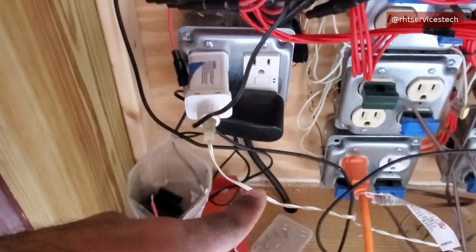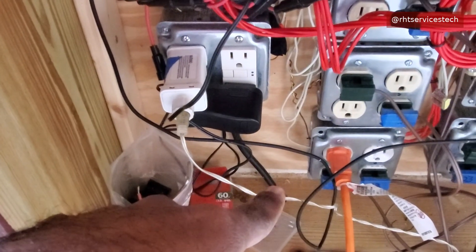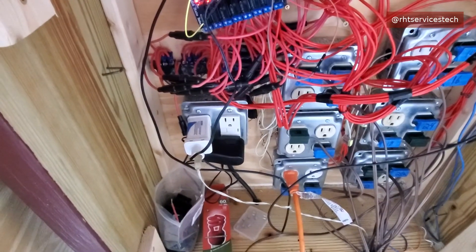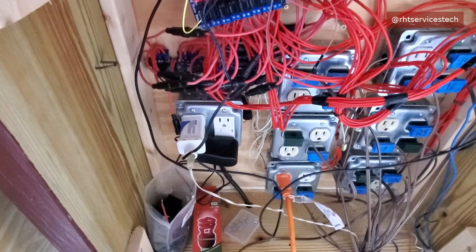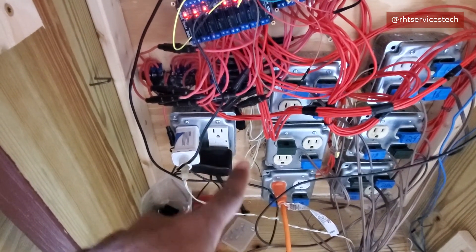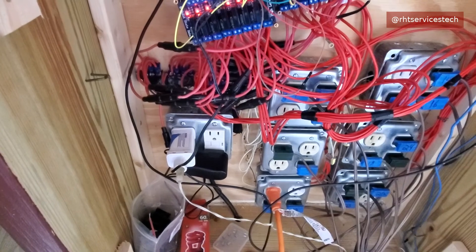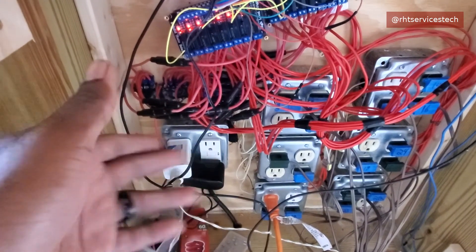Coming down, we have the incoming power that comes to this box. This box has a GFCI on it, so the power comes from the house plug to this outlet here. GFCI protected — the reason I use the GFCI in my control box is because my house was built in a time where GFCIs were not standard or even required. This is actually the only GFCI in the house. Last year it came into good use on rainy days because the tune-to-sign was developing a short with the ground, causing the GFCI to trip, so I ended up running the tune-to-sign with no lights on it because it kept tripping.